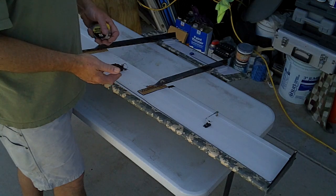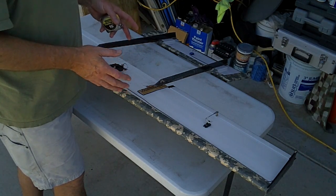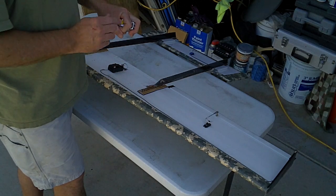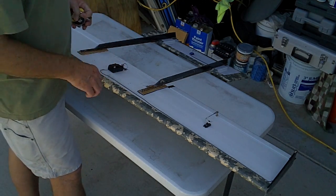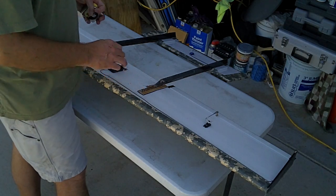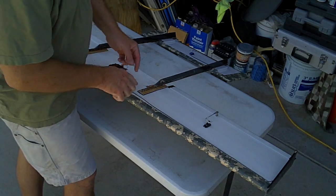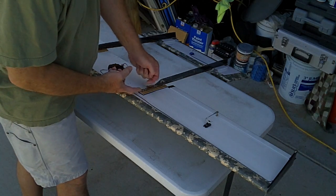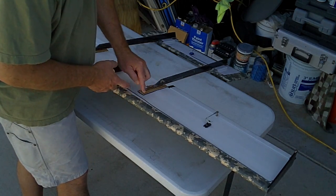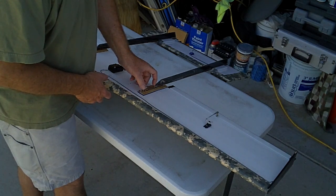Some critical locations, like all engine components, anything to do with the engine in the nacelle, has safety wire going on in there. So this is the same idea. I've taken a wire that is twistable, malleable, but yet it's pretty strong. And I go down and around the spar, and I come back up, I loop over, and I go back down and around, and I just twist tie it. And I've done that in both locations here.